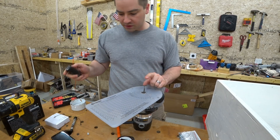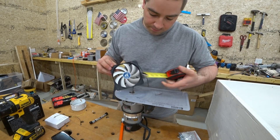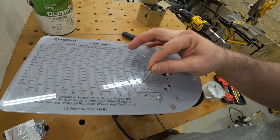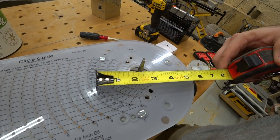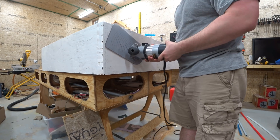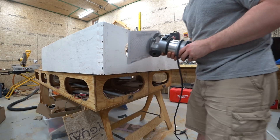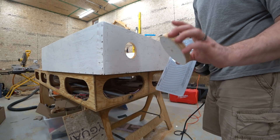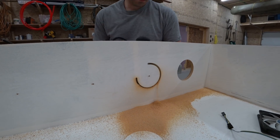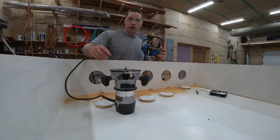I'll drop in some screws — I think this was a quarter inch spiral up-cut bit. I want a four and a half inch diameter hole, so to do that this circle cutting guide comes with a pin. You set it so the pin is at the halfway point of four and a half inches. The circle cutting guide works great, and next I'm just going to do a simple round-over on the edges.